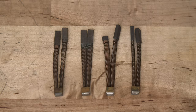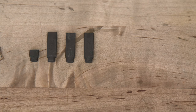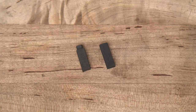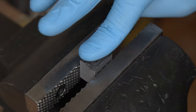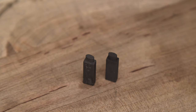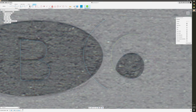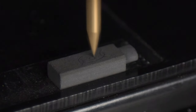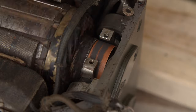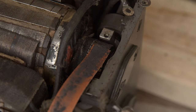When I removed the brushes from the generator, I found some of them were in decent shape, and a couple were broken. Because these are wear items, I decided to save the originals for future reference and make my own reproduction brushes for operation. I obtained some modern carbon brush material and sanded it to match the dimensions of an original brush. Next, I 3D printed a fixture that could hold a single brush with only the rearmost section exposed, and used this fixture to carve out the spring interface geometry on the back of my repro. I prepared high-resolution scans of the original brushes and traced their markings in Fusion 360. From this geometry, I used a CNC engraving machine to apply the appropriate markings to the reproduction brushes. I then installed the brushes into the generator and wrapped sandpaper around the commutator rings, spinning the rotor by hand to shape the contact surfaces of the brushes. I thoroughly cleaned the generator internals afterward to remove any conductive dust that didn't stick to the sandpaper.